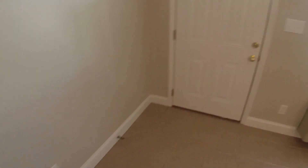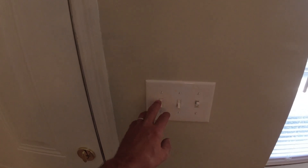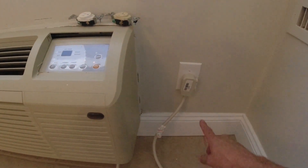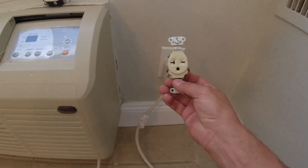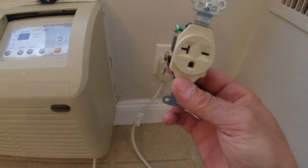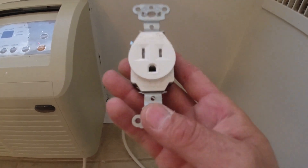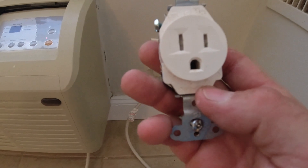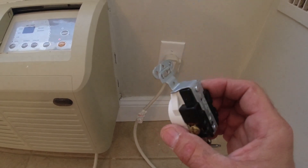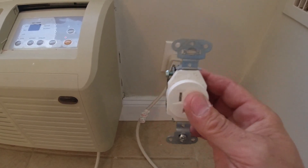Standard outlet, single gang cover. Over here you want to note this is a three-gang switch cover plate, and you'll have to take it apart to see if you have three-way or standard switches inside. Another thing you may run into is a cover for a dedicated outlet like one for an air conditioner — this one is a 220 or 250-volt, 20-amp outlet marked on the device. These are dedicated outlets, so you need to get exactly what's in there if you're going to replace them. You'll more likely see something like this 15-amp 125-volt outlet, which might be for a microwave or refrigerator. If you see these, make sure you figure out what they are and get the exact match.